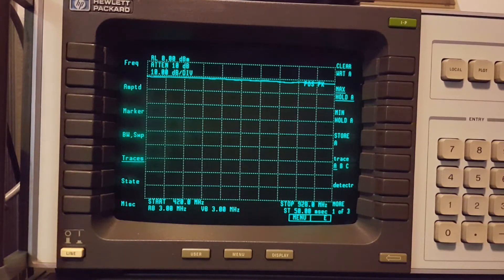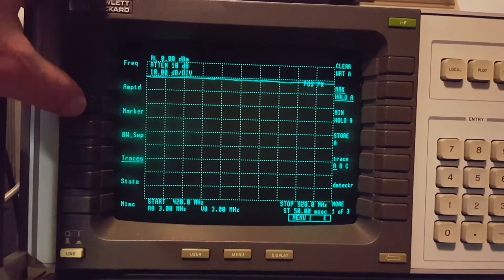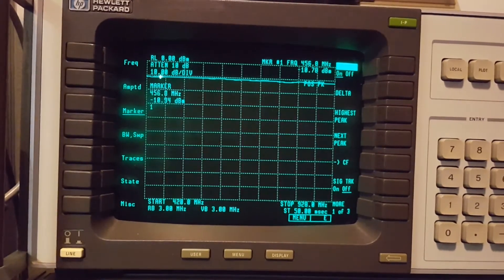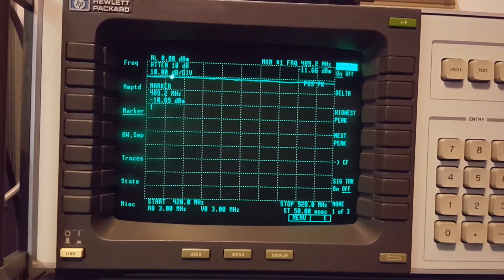How about that - I think we've pretty much reached the limit. I bet I could go to the 23-centimeter band, but I think it would start getting a little too lossy, especially with the SO239 connector on the end of that duplexer. But yeah, it's still under a dB. It'll start dropping there. We're starting to get down to a couple of dB below my minus 10 dB reference. I'm actually pretty surprised that this thing does as good as it does.